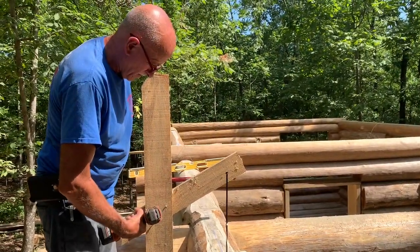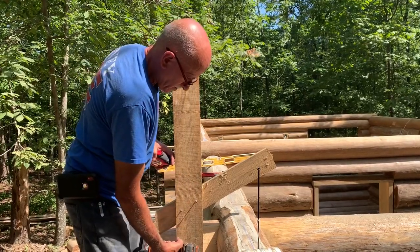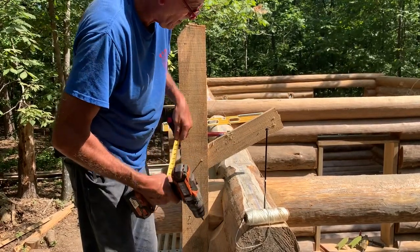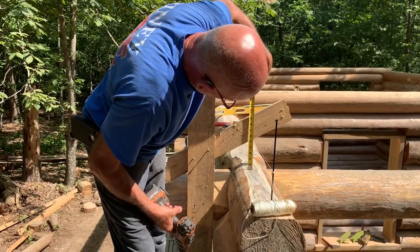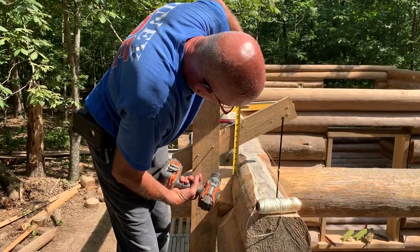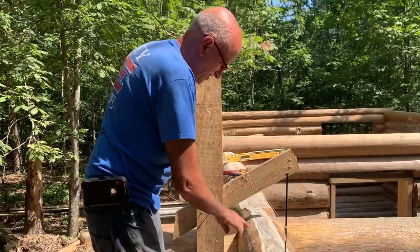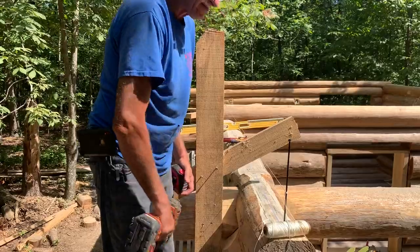What I'm doing here: Cinda made a six-pitch guide — this is for the six-pitch roof. I leveled this and just screwed it to my beam. We want that six pitch to be here. So if you set this all up and measure down to your center line and get that dimension, then come back here and run that dimension to the bottom of your truss, you can mark your line right there. Then I'll take the saw and cut from that line to here. That's how we'll get our angle so the tongue and groove will set down good on that — be solid.